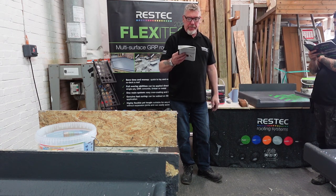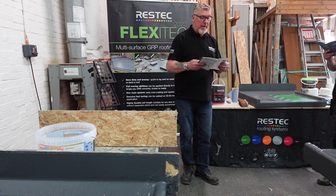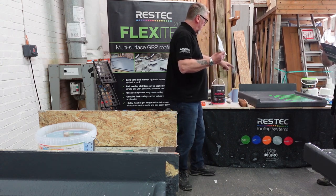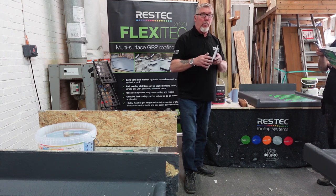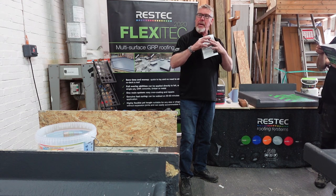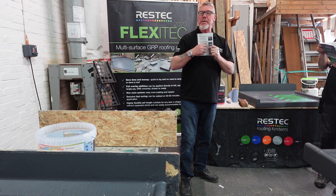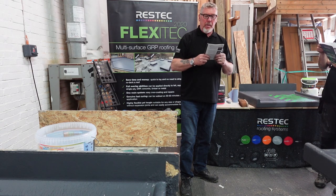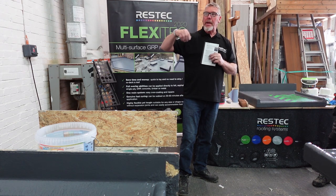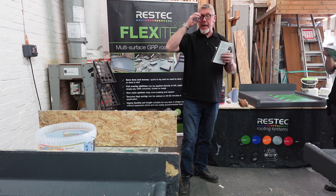Okay, so felt roof, yeah. Right at the bottom there, it says primer required. 2020 primer, when we use the white one, yeah, okay. Clicking over a page, asphalt roof. So if you've got cracks in that asphalt roof, Acryltex fills all them cracks in, yeah? If you've got a blowhole in the roof, that's come by the fact that the asphalt in that area is quite thin. Moisture's found itself in that area. It's superheated because it's black, and it's basically forming a big steam bubble underneath it. So really you need to break that out. Smash it out, use the levelling compound, just get it nice and flat. But somewhere on that roof, there were some little chimney vents that were put in when the asphalt was put down. Now them asphalt chimney vents, although you might think it's redundant now, they're actually kicking back in again.